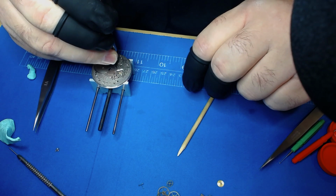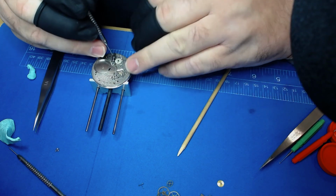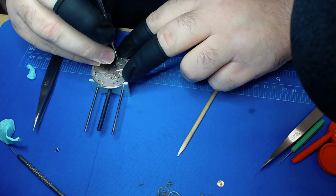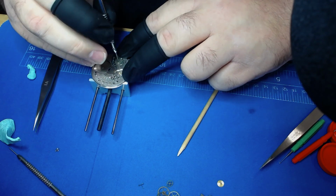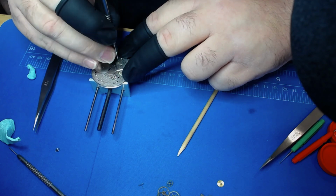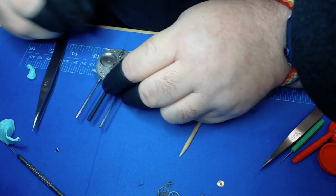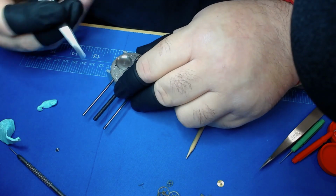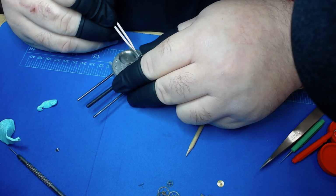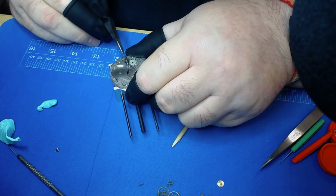That requires an additional bit of gearing called the hack, or known as the hack at least, which will basically freeze the seconds hand. So if you want to set a watch precisely, you want to be able to set the seconds hand to, let's say, 0 seconds, pointing at 12, and then set the time, and then, on the third beep, get the time going again. You can't do that on these old pocket watches. They don't have hacks in them. So wherever the second hand is, that's just where it is. If you're looking for precision timekeeping, this may not be for you.